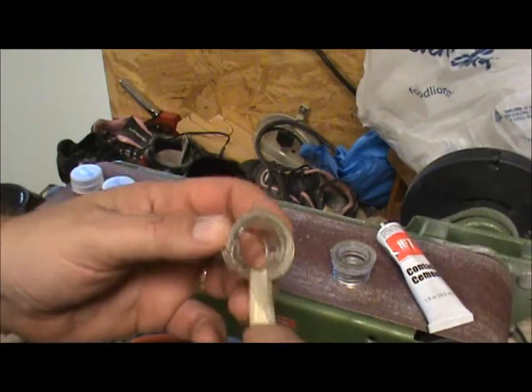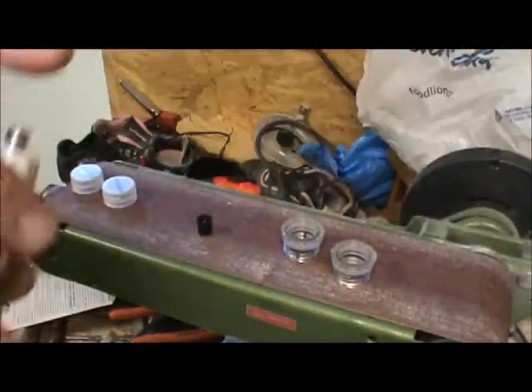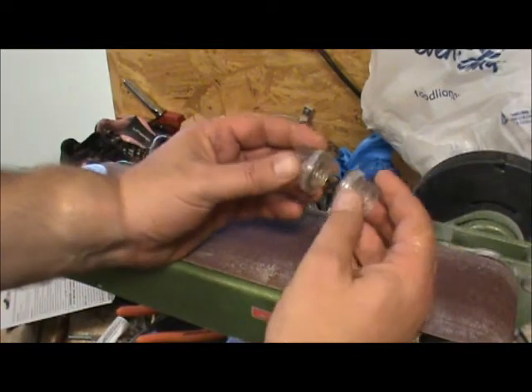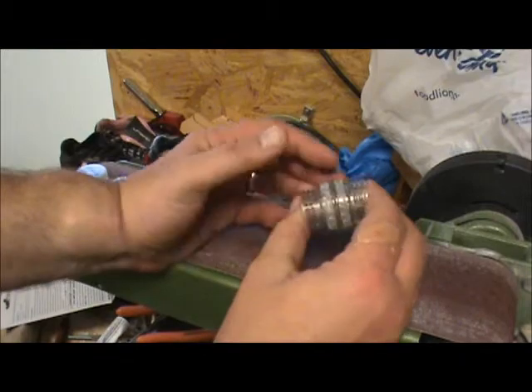Your main objective here is to get a good coating over the whole entire surface so when it's ready they'll go together and stay together. Let that dry. Now that it's dried for 10 minutes, you simply pick them up, put them together, and you've got contact — that's why they call it contact cement.